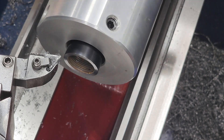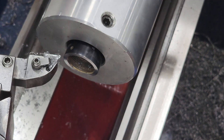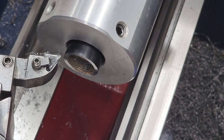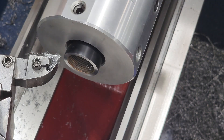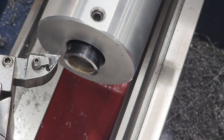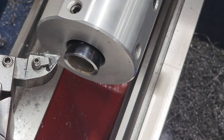So that is about 99 percent cleaned up and I think I'm gonna be happy with that. There's a tiny little dip there and a tiny little dip there - that's not gonna matter. All we're doing is squaring the face up, so that took three thousandths of an inch to clean that up - not too bad.